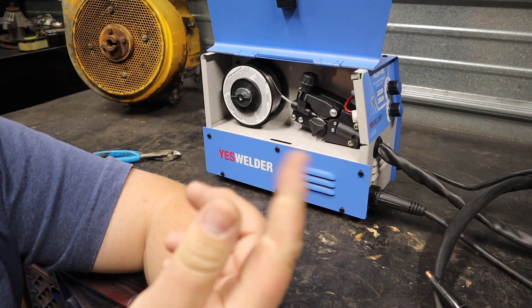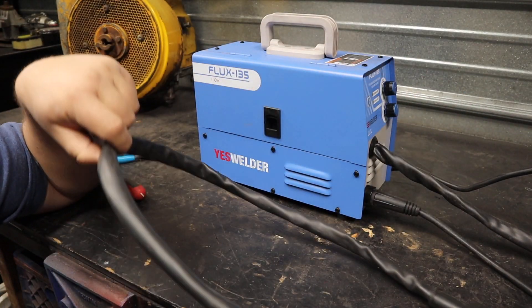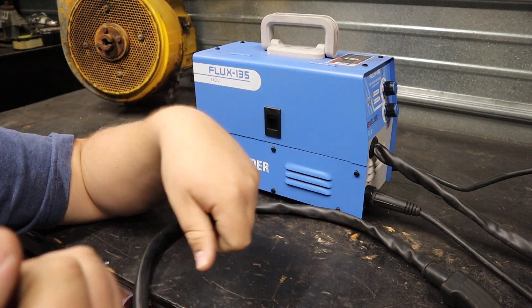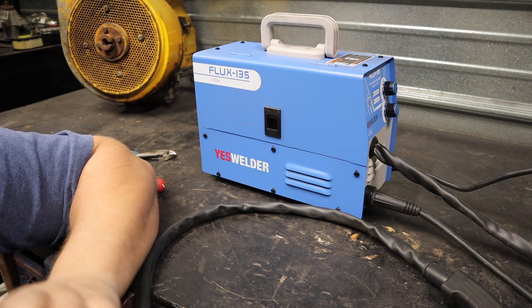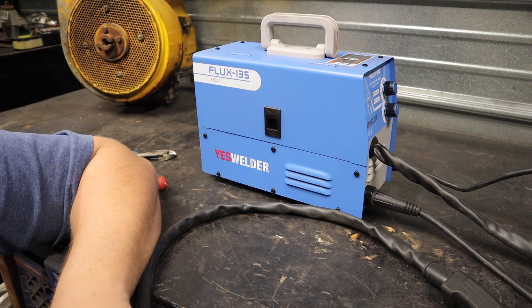Be careful using the finger method, because you could send that wire through your fingers — that has happened to my younger brother before. Another tip: you can see how this cable is kind of twisted up. You're going to want to pull out your gun and untwist it whatever way feels right, and get it in a good place where you can feel there's not too much tension. Otherwise you're going to make that wire drive mechanism work really hard.